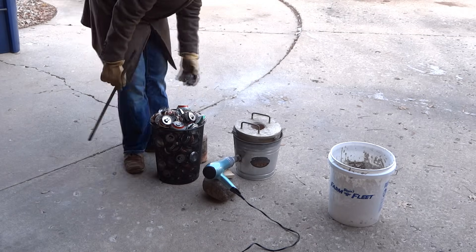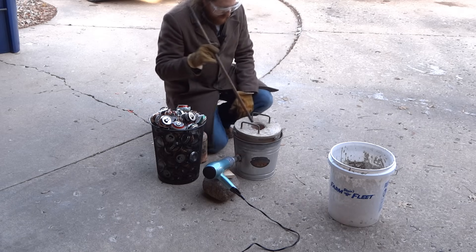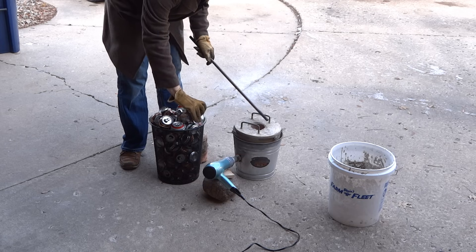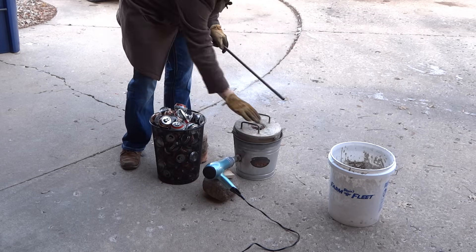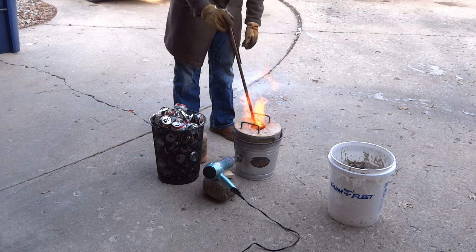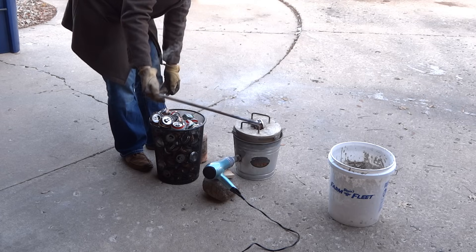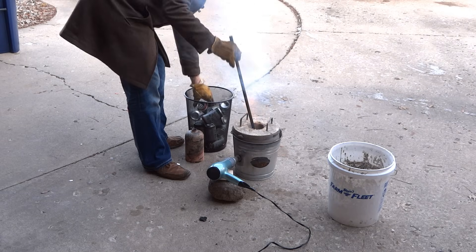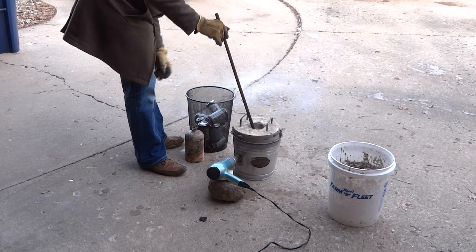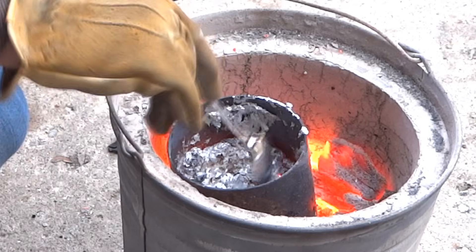Alright, can time. Here's how I'm going to do it: I'm going to throw a can in, let it sizzle for half a second, make sure all the liquid's gone, then shove it into the pool with this and watch it melt. Sizzle, push into the pool — and the can's gone. I'm going to try a couple more cans at a time. Sizzle down into the pool. Whoa, fire! Careful with the fire. I already see a flaw in this system — this pole is getting hot. Also, the hole isn't big enough for some of these oddly shaped crushed cans. I think uncrushed cans work better — you can plunge them really fast.